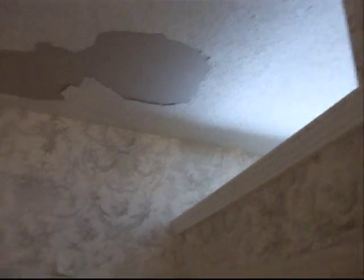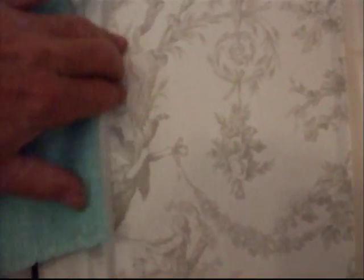We're not sure of the type of tile we're going to be using, but we're going to take it all the way up to the ceiling. That helps because the trim pieces going all the way around the ceiling get pricey — usually $3 to $5 a lineal foot, which can account for about $80 of trim just along there. So we're going to try and take the tile right up to this door jamb, and that's going to save some money on the trim — bullnose. We'll have a couple of pieces of bullnose there, and eight lineal feet of bullnose going up this wall. And of course I always put in a niche, so the niche is going to go in the back wall here, and we'll frame that out with the bullnose as well. So that cuts down on the cost a little bit.